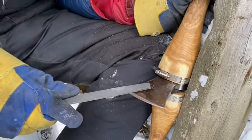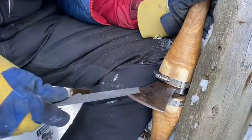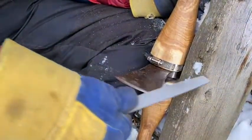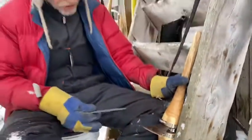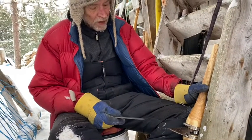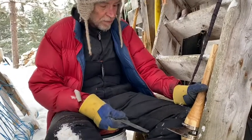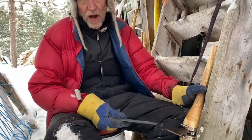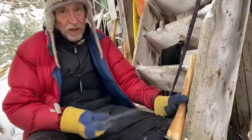So I've taken some strokes on one side, and then I'll try to take the same number of strokes on the other side. Typically, if I'm working on a blade that's just been dulled from use, I'll start with ten strokes on one side, flip it over and do ten there, flip it back and do nine, then eight — progressively less, but working on each side.